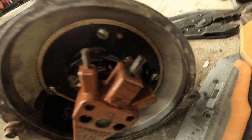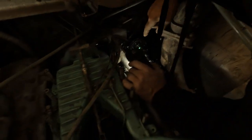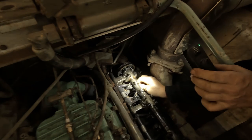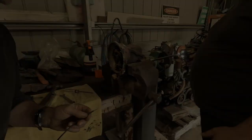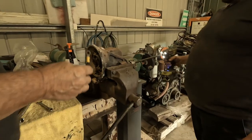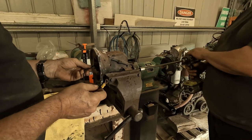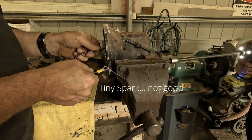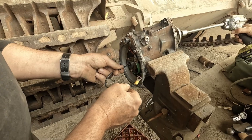We'll go into the specifics of how this works and why in another video. Before we could do anything we first needed to ensure that the engine itself had been correctly set up for timing. We do this by removing the rocker cover and checking the timing on the crankshaft. Fortunately the engine was indeed set up correctly. We already had our suspicions about the magnetos, so instead of timing them straight away we decided to pull them off and give them a good clean. We tested them both before and after cleaning, and to no one's surprise they were indeed faulty. For comparison, a healthy magneto should jump out at least a centimeter.